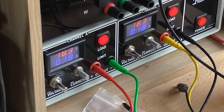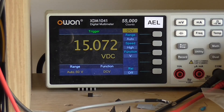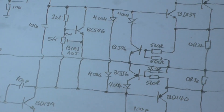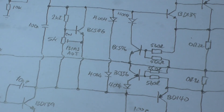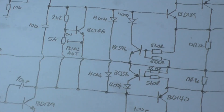Across that 100 ohm resistor we have 15 volts, which equates to 150 milliamps of current going through the output stage, and that's as low as it goes. Looking at my hand-drawn schematic, it did work on breadboard but it's not working on the PCB. The only thing I can think of is maybe these two diodes are causing an issue with the biasing network — it shouldn't be, since it worked on the breadboard.